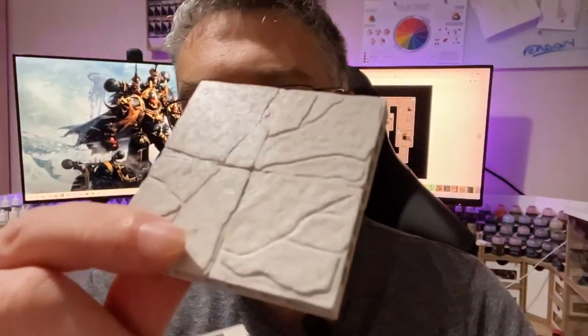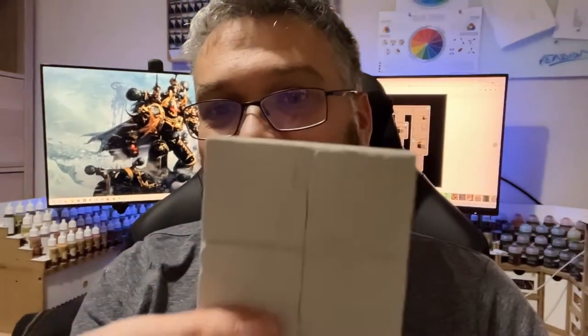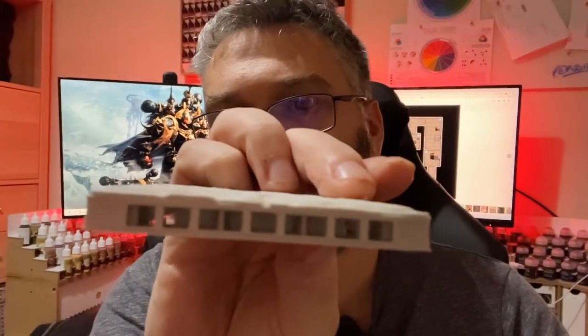So you've been printing for days — what do you get at the end? Well, this is the tile when printed: lovely texture, nice little supports on the side. You need to clip those out. First thing in the finish is to make sure you clean any of the edges — I print with a brim, so the first thing you need to do is remove all of those, otherwise they're not going to go together. Then clip those little bits out: here's a side with all the supports left in, and here's the side with the supports taken out.